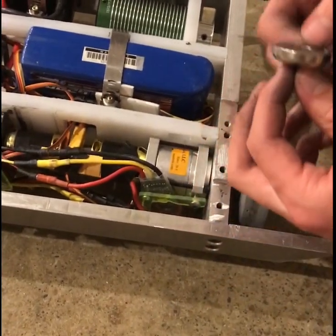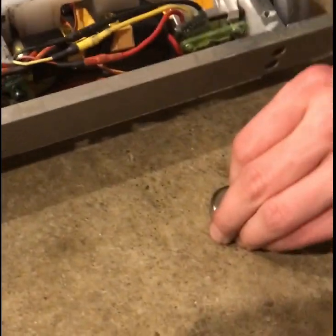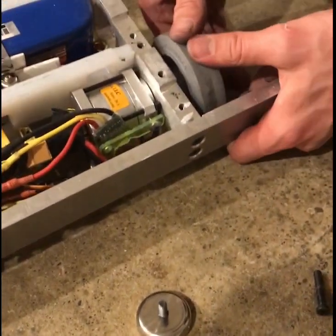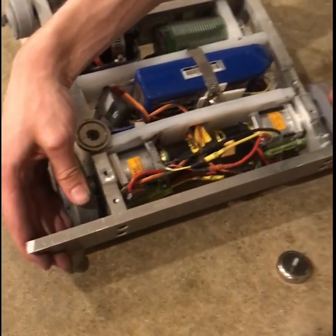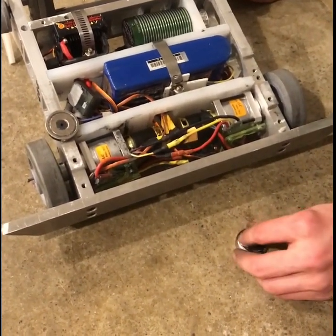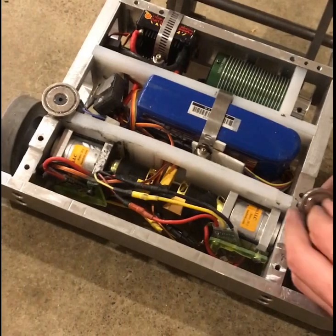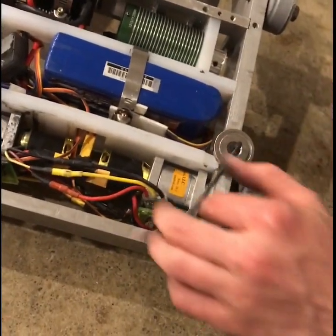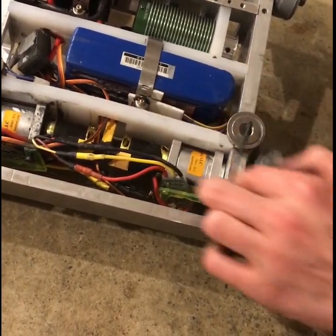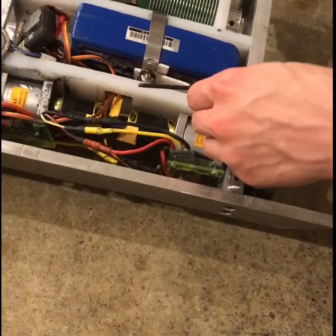However, they are beneficial, because as long as they're not dragging on the ground, they apply more force to the back of the robot, and it causes the rear wheels to be crushed against the ground. This increases the friction and really increases the traction as well, and allows the robot to push with more strength. Also, because the weapon is very heavy, without the magnets the robot tends to pivot forward, and that causes the rear wheels to make less contact with the ground. The magnets just ensure that the drive wheels are able to move the robot easily.